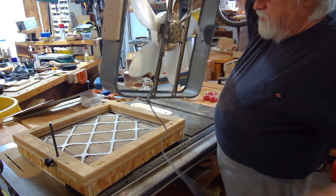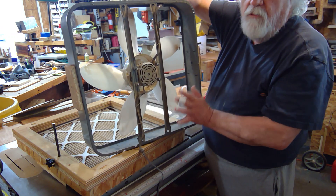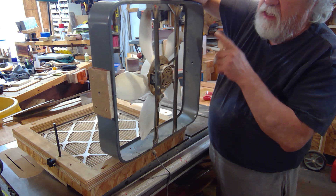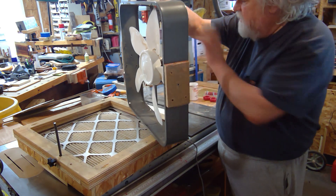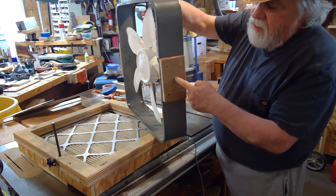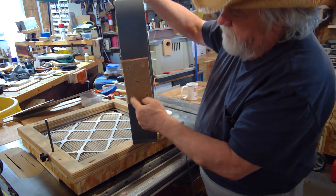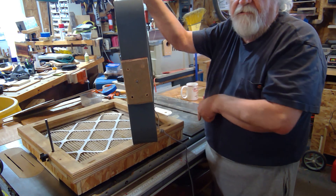The only modifications I made to the fan are: I took the back cover off — we don't use that at all — so that this surface will mate to our filter box. And the other modification was I made two plates, one on each side, with a center hole exactly centered top to bottom on the fan. These are just three-quarter-inch plywood, and I got four screws that I screwed directly in. They're not too long, so they don't hit the fan blade when it's turning.